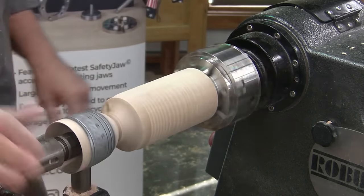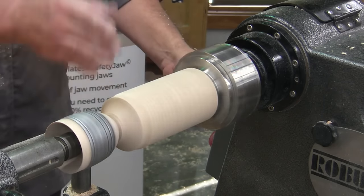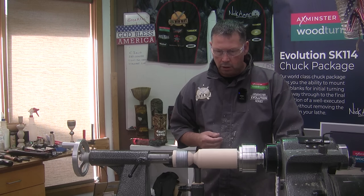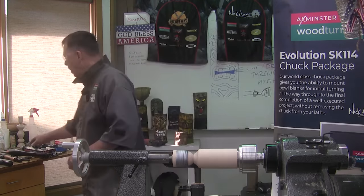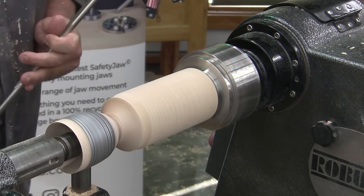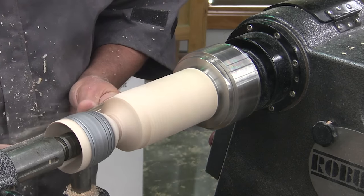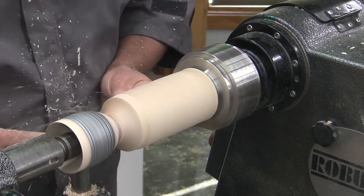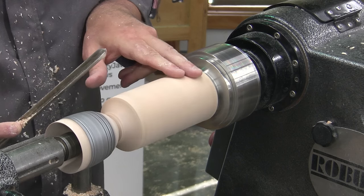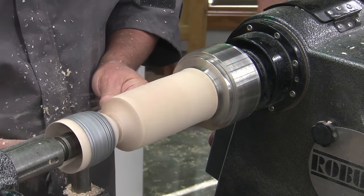So that's all nicely supported. Let me speed back to zero again, turn the lathe on. I'm going to start off by just cleaning the surface, giving myself an idea where to put the parting tool, or where the parting tool needs to be to part off. So let's do another sheer cut with that gouge, up to about 1500 to 1600 revs - part is fine. And remember, we want to keep this as big as possible, this diameter. The idea is to have it slightly bigger than the actual chalice top.